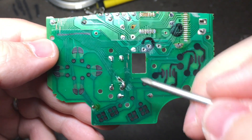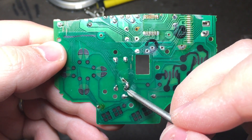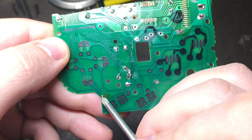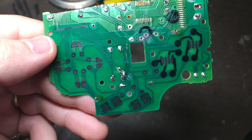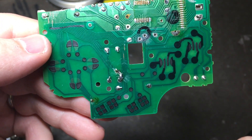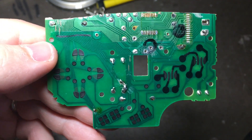It's not very pretty but you can see that I've bridged the bit of wire that was sticking out right here with these two traces right here, and then I put a bridge right here between these two traces. What that does is it makes it so that the ground half of each of our buttons are all connected to a single ground, so then we just have one ground wire to attach to our Teensy board.